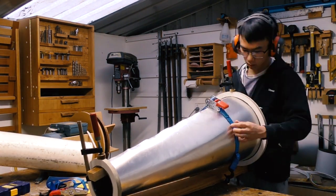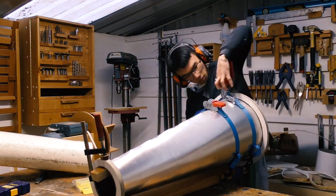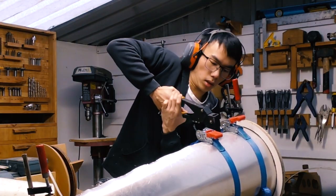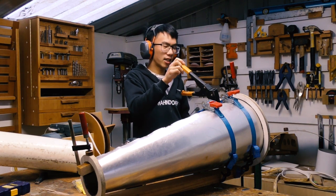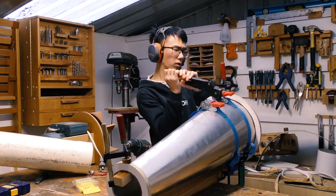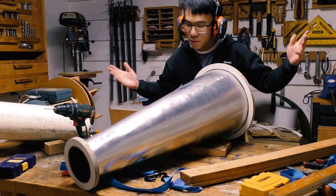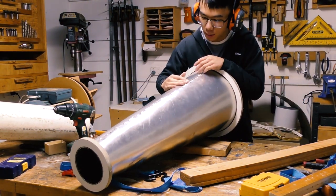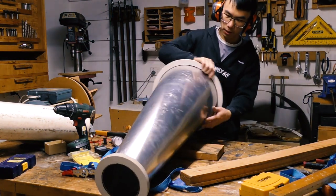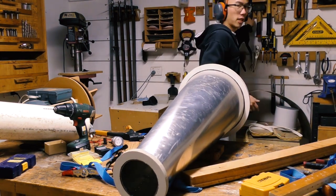I put a piece of wood across the wooden rims so that the clamping pressure wasn't directly on the aluminium, to avoid making another dent. After numerous scratch marks I'm proud to say all the rivets are finally in. Now I'm going to attempt to fix the dent — I'll lay on top of the block and hammer it gently, hopefully without breaking off all the screws I put in so hard.